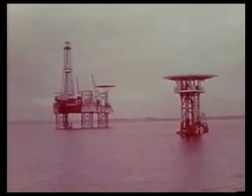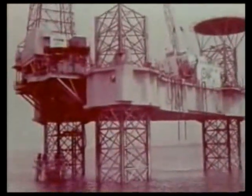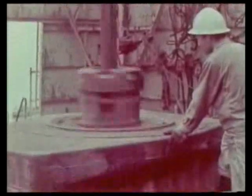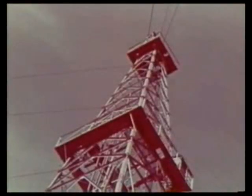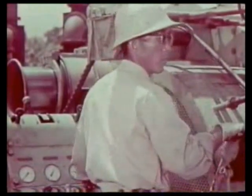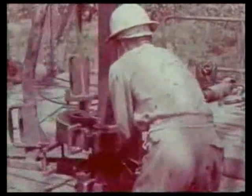An oil well rig — this equipment exploits chain drives most relentlessly. A rig of 1,000 horsepower is required to sink an oil well 3,000 meters. Moreover, the rig must be shifted from place to place after a two to four month operation. Thus, the equipment must consist of parts extremely light in weight and compact in size, which can easily be assembled and disassembled.